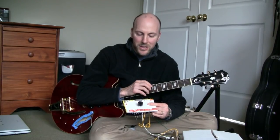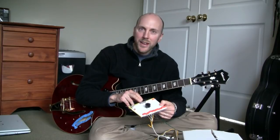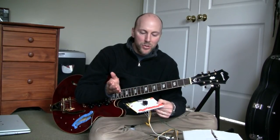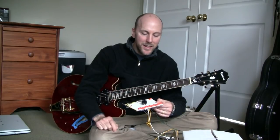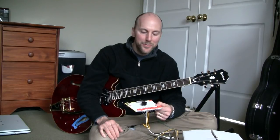Now, if you've listened to this and you still can't decide or it's not clear to you, do what I did. Make a tone thing. This is pretty cool. It didn't take long to do. As long as you're not getting into these boutique high-end paper and oil caps, it's really not that expensive to buy a nice assortment of caps like this. And use alligator clips before you break out the soldering iron. Just experiment. See what works for you and what you like.